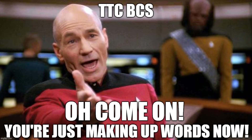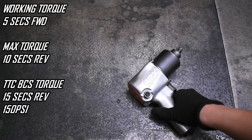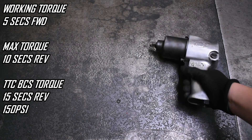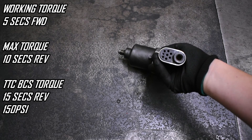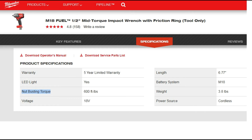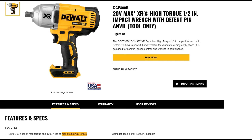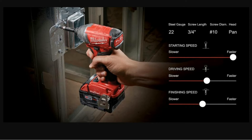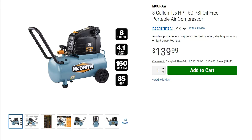With that in mind, in our best-case scenario test we're going to be using 15 seconds in reverse at 150 PSI static pressure, which like on the 90 PSI test, will drop at least another 35 PSI or so while running. The reason for this test: 15 seconds seems to be the max test length I keep seeing online, and we want to be able to compare this test versus cordless tools we eventually test. On a cordless tool, you'd want a topped-up battery for a stubborn bolt — same on an air tool, you want your compressor topped up. A compressor that hits 150 PSI is both common and affordable for a home gamer nowadays.